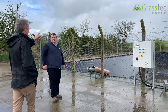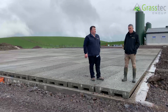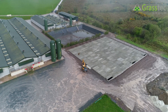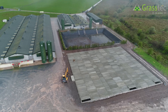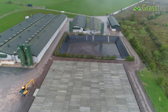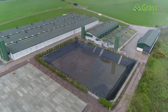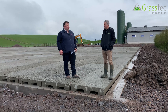So we'll have a look at the adjacent tank where the new pipe work is going in. We're standing on phase two of slurry storage and future housing. This is a very large underground storage tank which the customer has put concrete slabs on top of. Our system has the ability to mix this as well, so we'll be adding on to the existing system that's in the lagoon — saving the cost of a separate blower and control panel — and that'll allow it to have the same consistency across the whole unit.